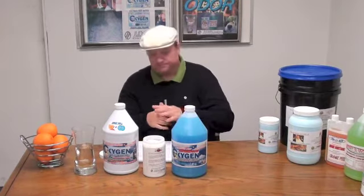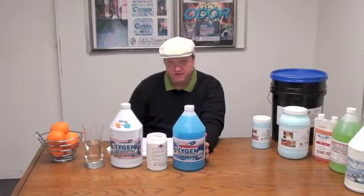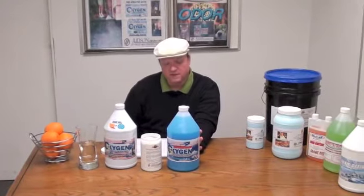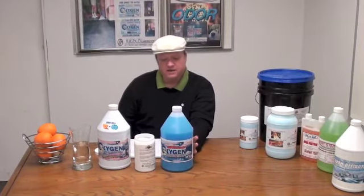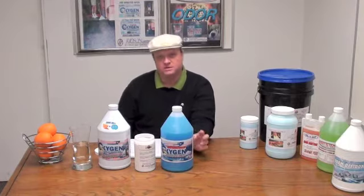The neutral rinse has borate, sodium borate, which has oxygen brightening properties and disinfectant properties. We also have a surfactant that gives it cleaning ability. Also the borate gives it cleaning ability. By leaving borate, when you're extracting, the moisture that's left in the carpet continues to brighten dingy areas. It deals with wicking issues because it's trying to get up through the borate that's in the carpet.